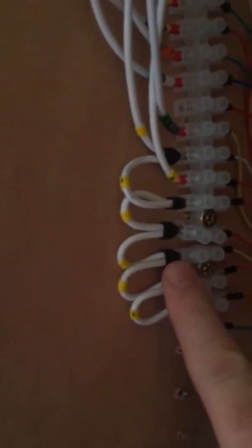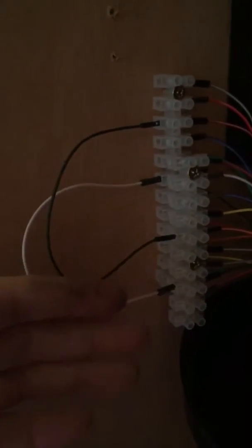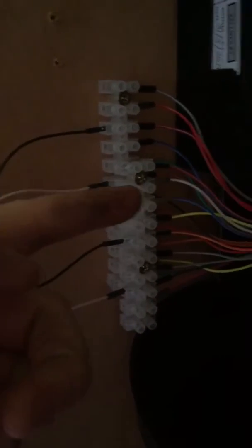All the other coins I allow. As for where the coins go, there's a slot at the front there with 4 holes coming out of it. By programming the routing, in other words by shorting out a couple of routing pins, you control which coins drop out of which hole. I wanted pounds and tens to come out of separate holes, travel down and land in the pound or the 10 hopper. So that's what I set it up for.